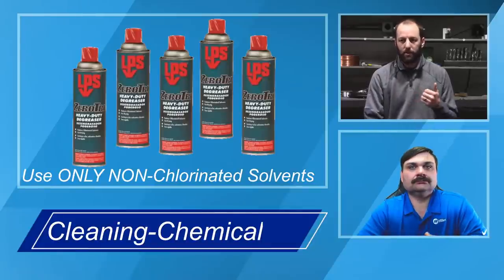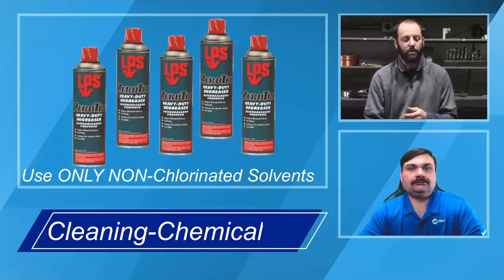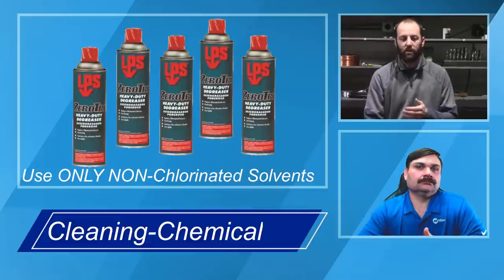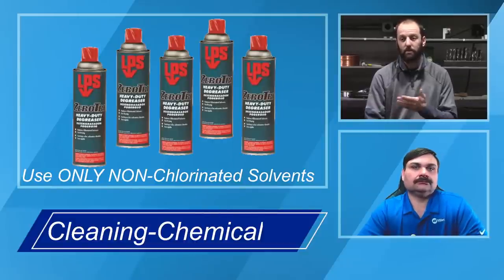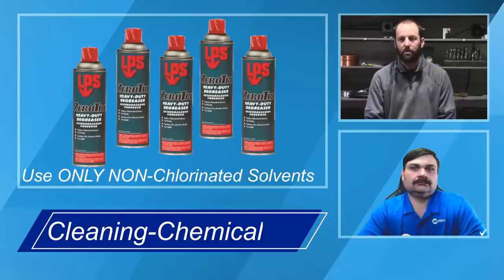And ultimately, they're going to do chemical cleaning with a solvent to remove even oils from your fingers, things like that, that could be on the component as well as on the filler material. They're going to do a wire brushing process, and generally they will do another wipe with a second rag. A lot of times they use a cotton rag with a solvent pumper and wipe down a second time after they do the wire brushing with the stainless steel wire brush.